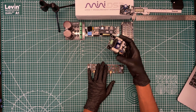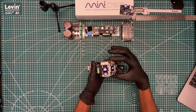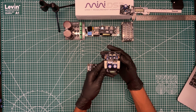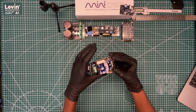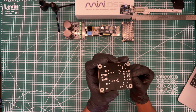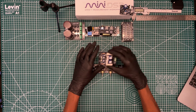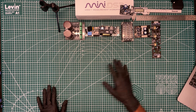To power the sub pre board you will need another board — a hi-fi audio grade rectifier, not a typical rectifier you get in the market. Just look at the number of components used to convert AC to DC at 12 volts. You give it a 12-0-12 AC input, it gets rectified, and the DC voltage comes out here. They have resistors to discharge. Look at the PCB — so well built, all hand soldered, everything made by hand and inspected several times. It looks so beautiful and symmetrical. These two are a combo.